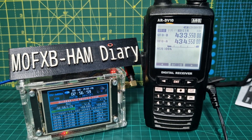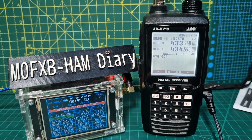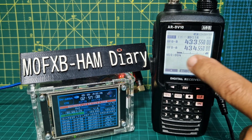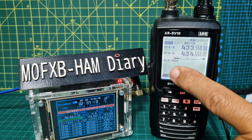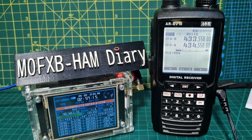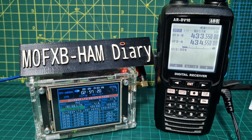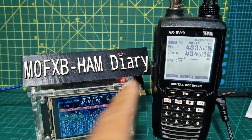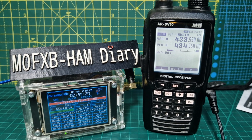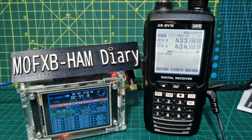On the left we've got the DVMega Genesis transmitting D-Star, and on the right we've got the ARDV10 scanner receiving on the A-band D-Star. But on the B-band it will actually receive C4FM, analog, DMR — whichever you want, but not at the same time. You'll only ever hear one at a time, so just wait for someone to transmit here on my hotspot or a local repeater. Remember, it's a receiver only, and this is really the only handheld receiver that will receive all modes including HF bands in one unit.